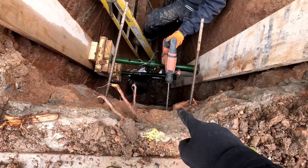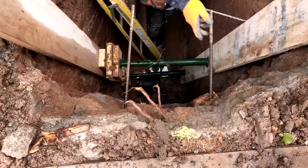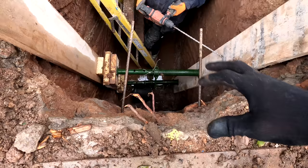You've got the ridges on this rebar which acts as a locking device. So once you work that through into there, it's absolutely solid - you're not getting that out. There's a little bit of wobble on it, but you'll never be able to pull them out. So once all this concrete's in, it's going to lock this together nicely.